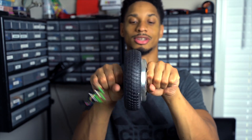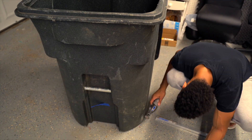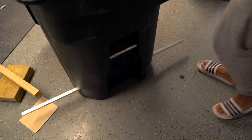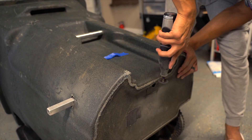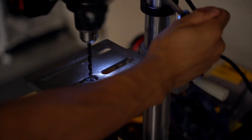The hardest part of this project was installing the tire, because keeping it stable with the plastic trash can body was tricky. What I ended up doing was installing an aluminum bar, sliding it through the trash can, and cutting a hole in the middle of that bar for the screws that connect to the tire fork. I also cut a hole in the bottom of the can for the tire, then used a drill press to make screw threads for the tire fork.